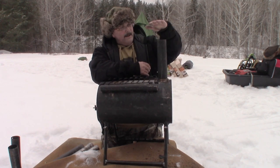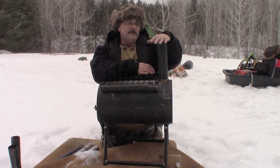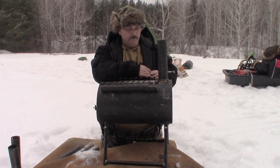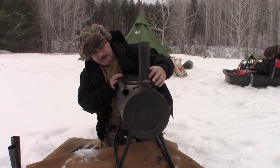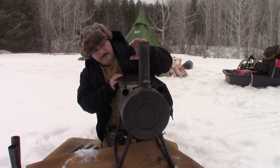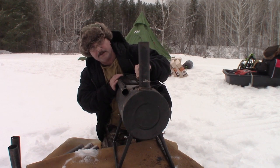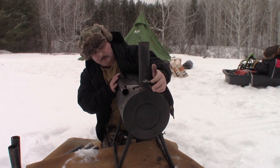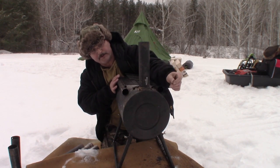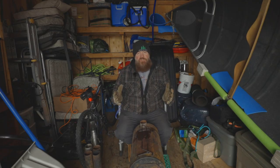This stove did not even have a damper, which I felt would be beneficial, so I built one. It's a quarter-inch bolt drilled through the pipe, with a piece of thin-gauge — I believe 18-gauge — steel fastened to it. By removing the pipe from the stove I was able to put it together and weld it inside the pipe, then welded a cross bolt on the end. When the cross bolt is horizontal the damper is closed; when vertical, the damper is open.